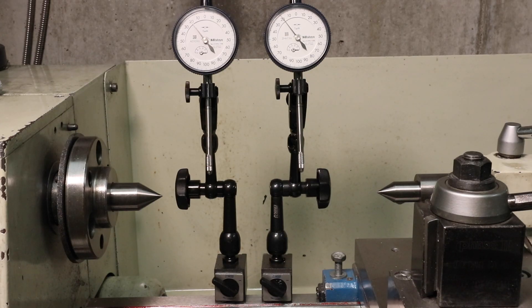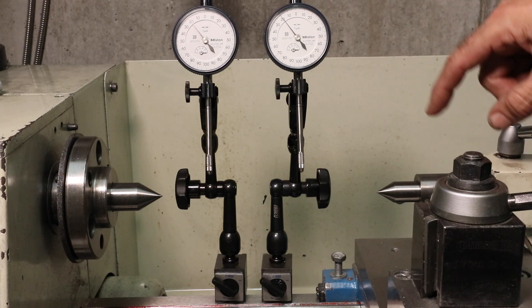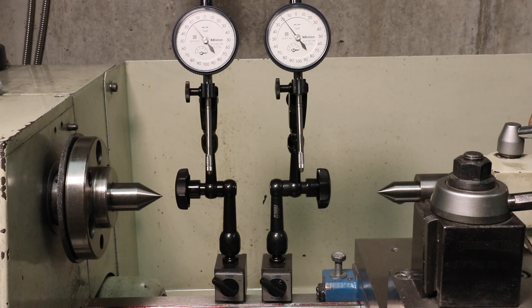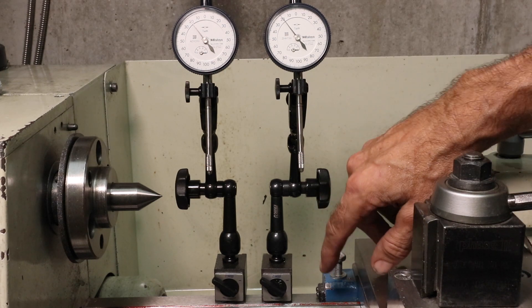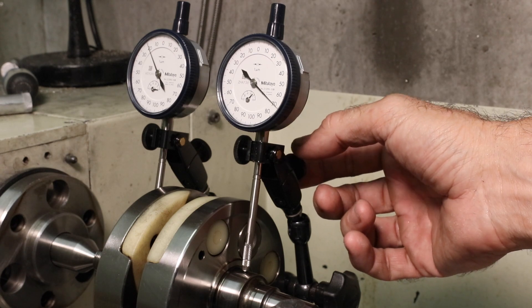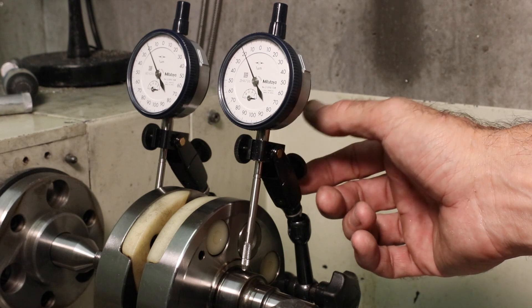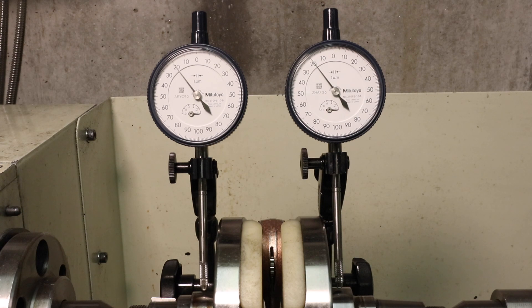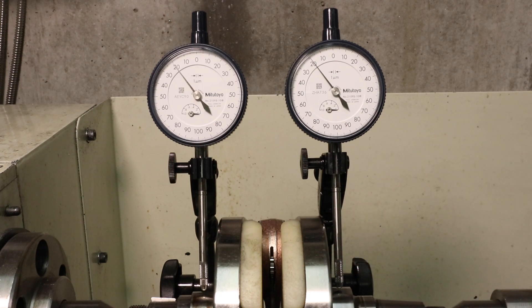This is the setup I'm using to measure run-out of the crankshaft. I'm using a lathe — I've removed the chuck and installed a dead center, and I've also got a dead center in the tail stock. I'm using two dial gauges; these are one micron per division dial gauges. I'll put the part number in the description. I've got them mounted using two Noga adjustable bases with magnetic bases so they can attach directly to the lathe. The Noga stands have an adjuster at the back which allows you to lower the dial gauge down and make a fine adjustment. The dial gauges are one micron per division and one millimetre of travel, and I've installed 50 millimetre extensions so I can position them directly above the bearing journals without interfering with the crank webs.